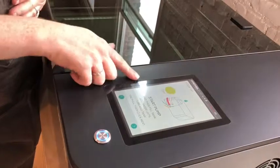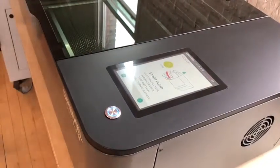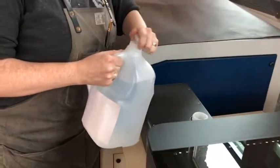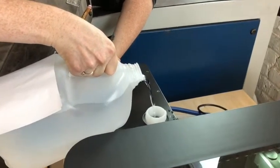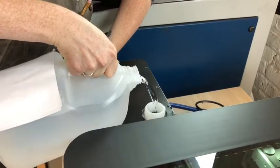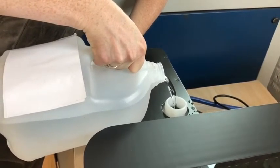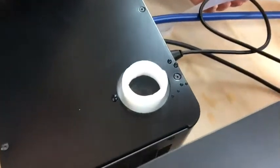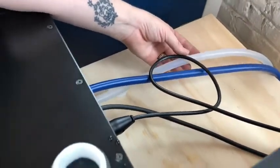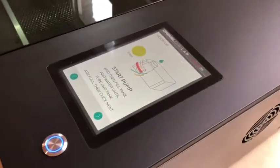Now, start pump. We're going to start the pump and fill the tank with water until it's full. I'm going to click start, which will turn on the pump on the hex box. Then I'm going to take this distilled water and pour it in. Now the water is flowing through the tube, so you need to make sure that you're filling both the tank and the tube. Slowly add the water. You want to make sure the tank looks full and that there aren't any bubbles visible in your clear tube. We've got no bubbles and our tank still looks full — so I'm going to take this cap and close up the water tank on the hex box.